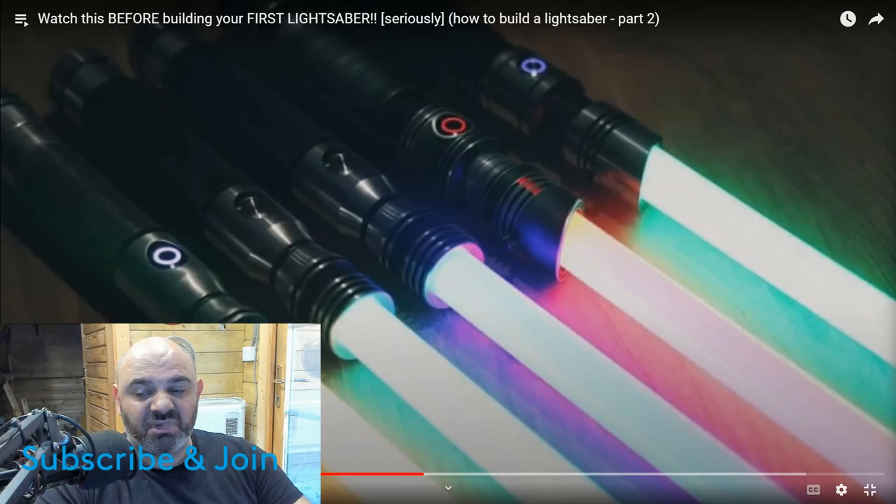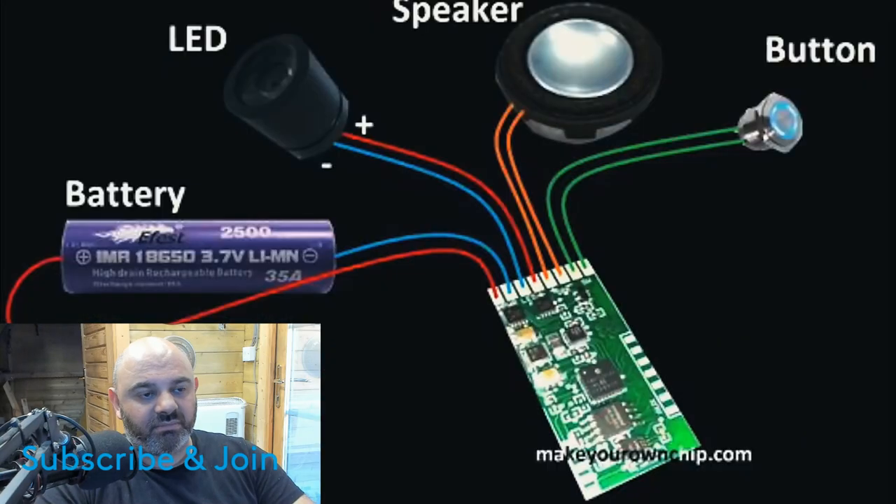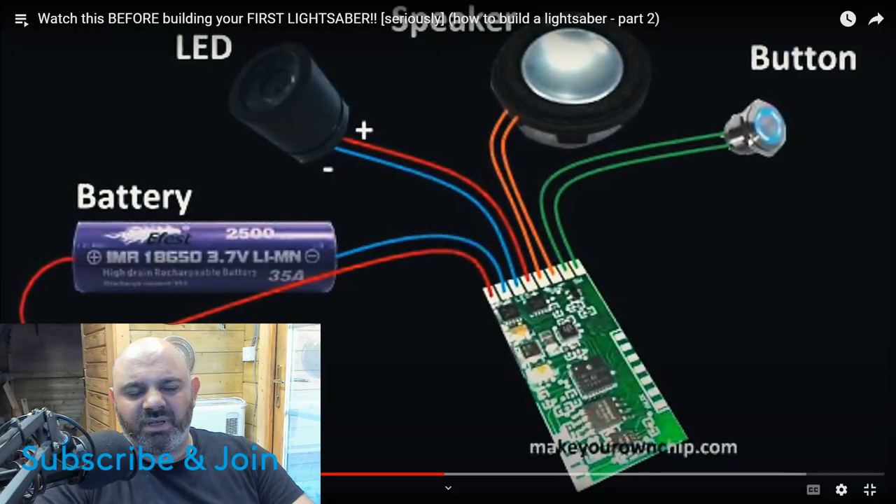There's a sound category that most people fall under even if they don't know it, but it's also the most complicated because you're going to need LEDs, speakers, soundboards, batteries, and other stuff. That's a soundboard for a make-your-own chip that I used to use. But it's not actually complicated at all - you're wiring the switch, wiring a speaker, wiring the LEDs, and wiring the battery, that's it. You wire on a charging port. When I had that set up, I had my battery going into a charging board, and the charging board went into the soundboard so you could charge it.